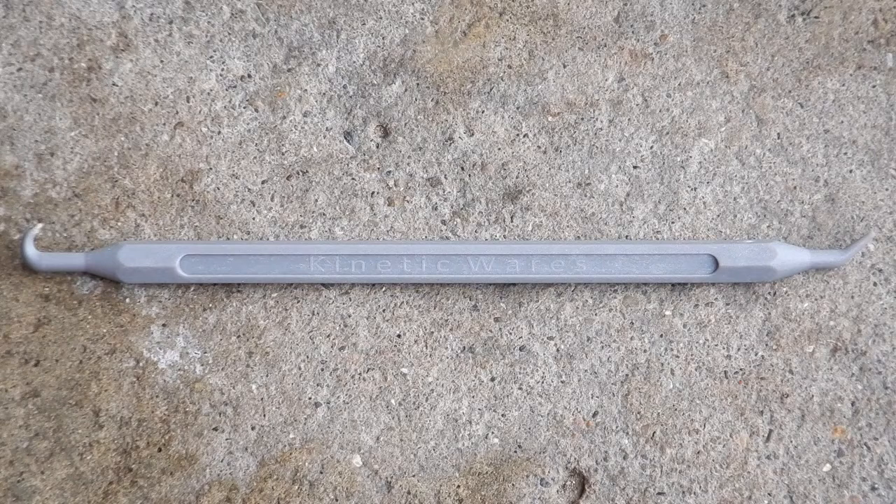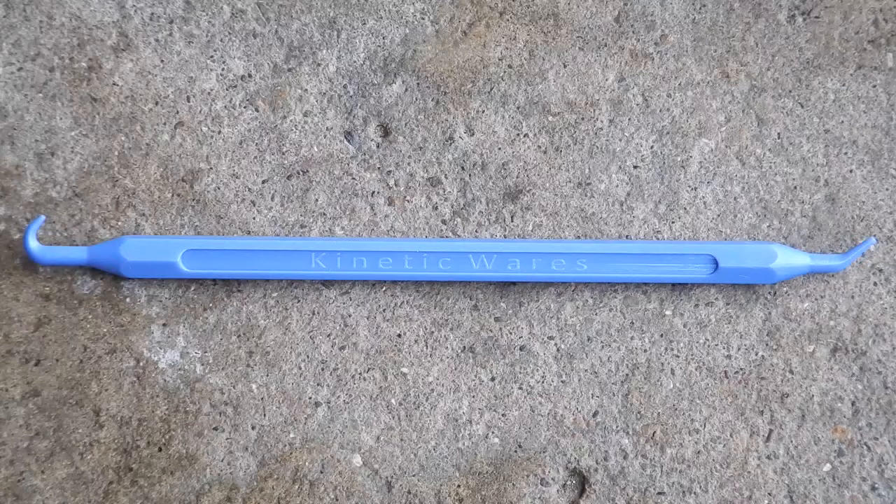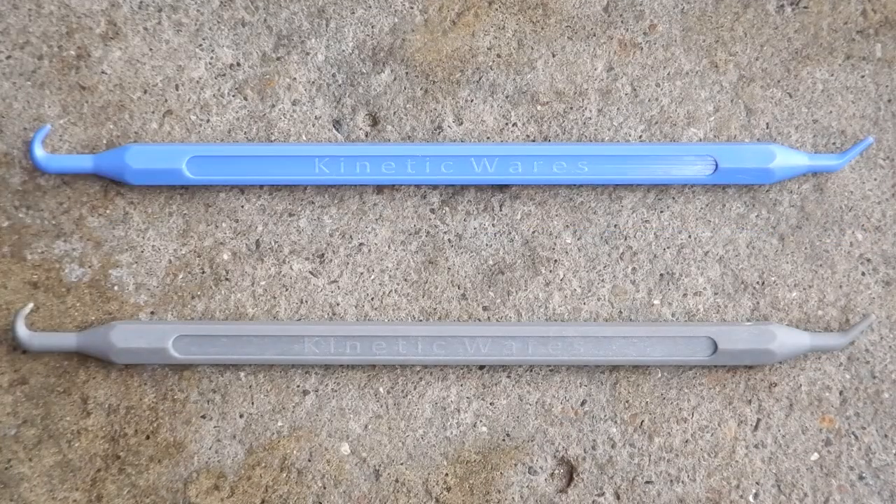As per the website, the gray o-ring pick tool is made of glass reinforced nylon — it has less flex and is stronger for use in automotive, air, or hydraulic fittings; they will take a little more abuse. The blue o-ring pick tool is made out of polycarbonate, which makes them more pliable and perfect for softer plastic parts such as water filter housings and bypass valves.